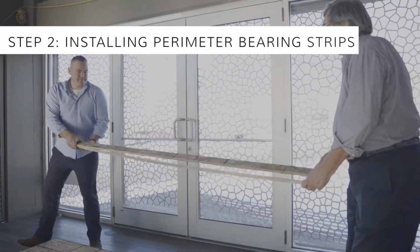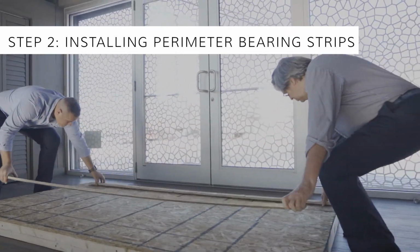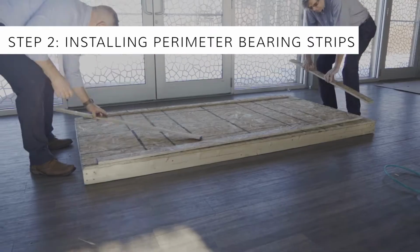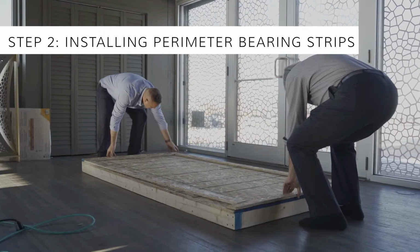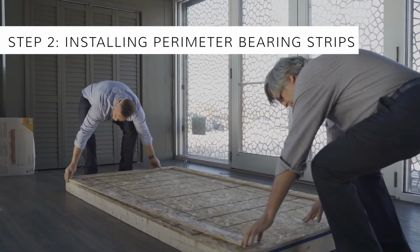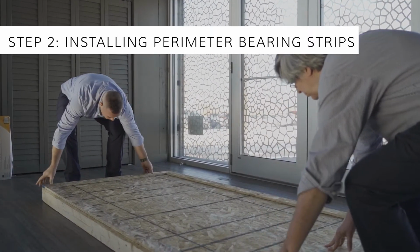The bearing strips are used wherever load-bearing walls or shear walls are to be installed, so that there's continuity of solid structure to transfer the loads. The width of the strips should match the wall stud thickness. The thickness of the strips is determined to match the sum of the 1/4-inch-high rubber pads plus the wood lath strips that are placed over the framing members in the next step.